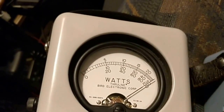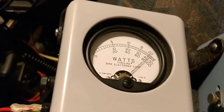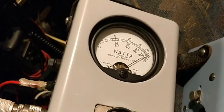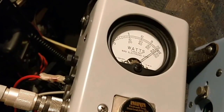Considering they calibrate the radios and set them up at just over 100 watts, I think that's pretty much spot on. I did check the calibration of the meters first — I ran them all on FM and checked each one against the others, and they were all reading the same power, so I'm safe that they're okay. I check periodically, and although my power meter is a little bit old, it's still quite accurate.